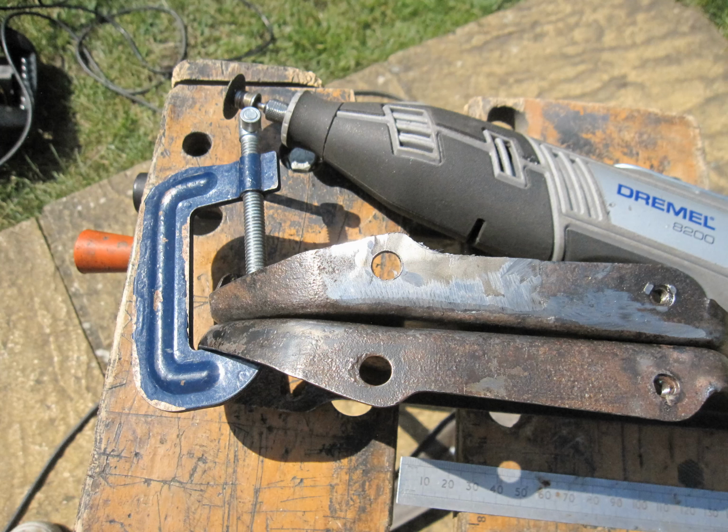edge. I used a Dremel grinder for this. Small grinder's perfect if you want to do any detail shaping. I use good quality grinding discs which are expensive but in my view well worth the money for the results you get. If you're buying a Dremel for this kind of work, get a big one. A mains version will work well and is much cheaper. Or if you want to go cordless, get the biggest to get the torque you need and also a spare battery.